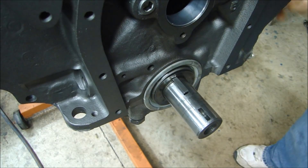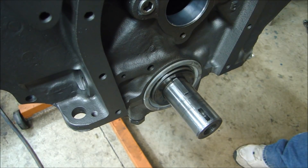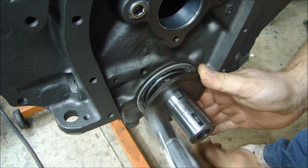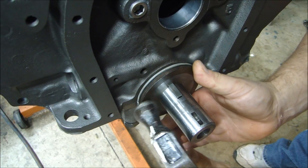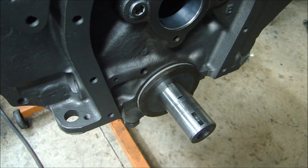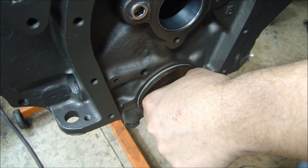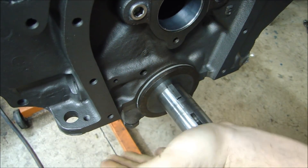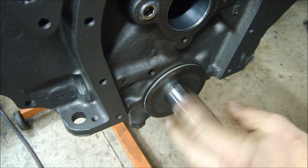It's not down all the way, so I've got to hit it down more. There — now I can just gently tap it on. So now that's sitting on there. My thrust plate is 6 thousandths off the front of the thrust. So now when I move this back and forth, it'll only move 6 thousandths. Now I can start to put the gear on.